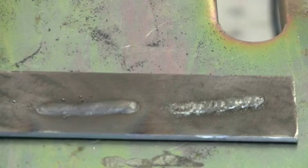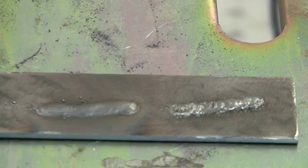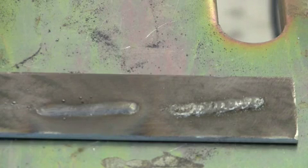In this video I wanted to show you the difference between using gas and not using gas, and see if you can pick out which one I had the gas turned off on. Of course it's the one on the right, and that is an example of porosity in a weld. It builds up a lot of holes in the weld when you don't have gas, and it weakens the weld.